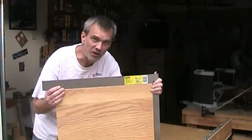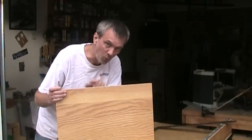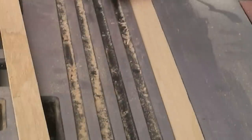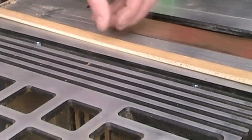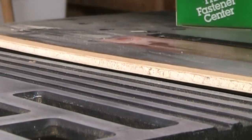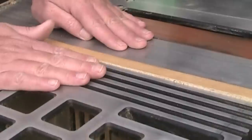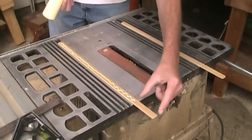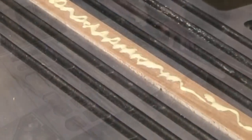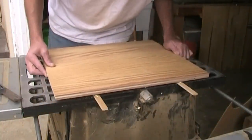I've cut a chunk of three-quarter-inch plywood pretty square on my table saw sled, but it doesn't really need to be that square. You just have to make sure you have one really flat edge. I've cut two long strips to use for the runners using quarter-inch plywood, and they'll fit into these slots just like that. If you saw my cross-cut sled video, you'll recognize what I'm doing here. I'm putting some nuts — you can use washers, whatever fits into those tracks — and then I can set the runner down on top of them just to get it slightly above the surface of the table.